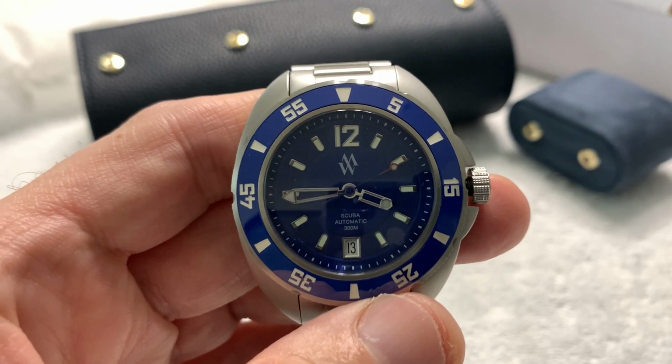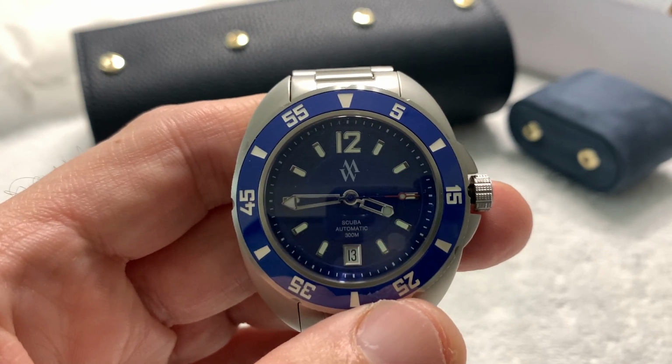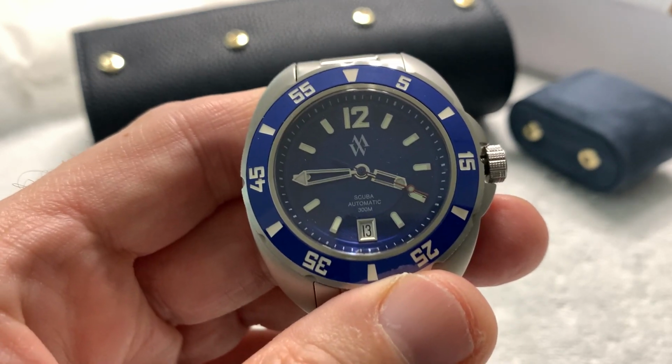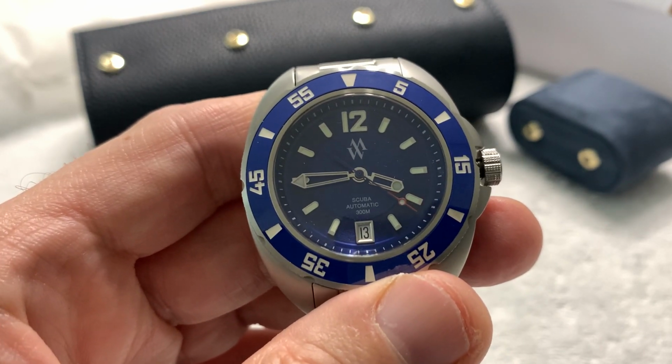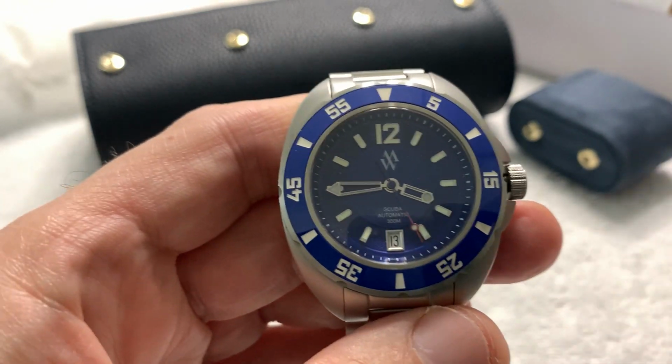I had a couple of watches that had SW200s in them, and those winding mechanisms, after a while, would just lock up, and you couldn't wind the watch anymore. They fixed that, or ostensibly fixed that, in the -1 revision.